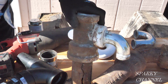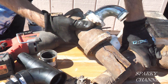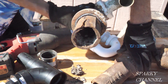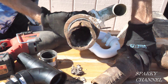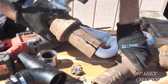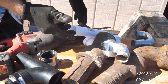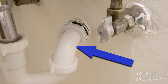It's best to just cut them out. In some parts of the country you use PVC — the white PVC — but in California we use the black ABS. See, some crud just fell out of this — it's all clogged up. It's totally clogged and there was no way to get it unclogged without cutting it out. Even if I did get it unclogged, it would still have a crack and leak water in your wall.